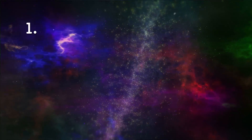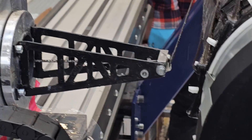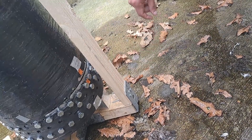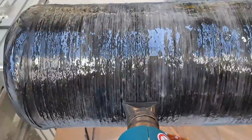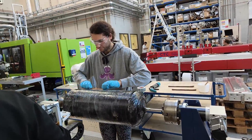Last year we had three main problems with our flight tank. The first and biggest problem was it was really heavy. We didn't have a lot of tank building experience and went through a whole bunch of design iterations that turned out to be unsuccessful. In the end we settled on this battleship version of the tank, which was essentially a steel tank which we then overwrapped with carbon fiber.